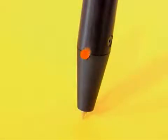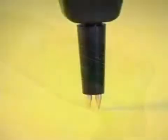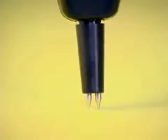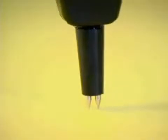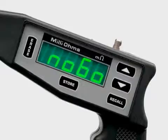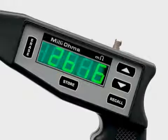If the light switches from green to red this means that the continuity has been disrupted and the display panel will read ERR. When this happens gently rock the tips back and forth or from side to side — this will penetrate the surface and give you the continuity you are after. It is very important not to twist or use excessive pressure on these tips. If you see two green lights but the display reads 'no go,' this means that the meter cannot push a large enough current between the two probes in order to make a measurement. If you see the message 'too big,' this means that the measurement value is beyond the meter's range. In both cases the meter will not give you a reading.